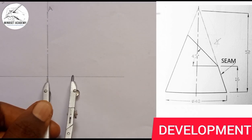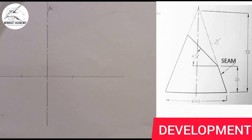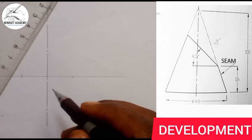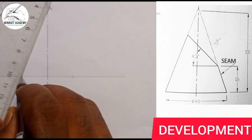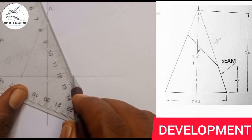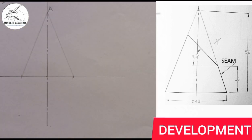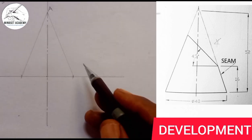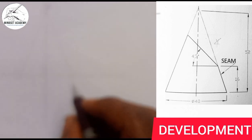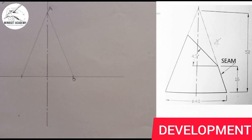I place the center at this point and mark 20 to the left and 20 to the right. From here to point A I draw a front line, and again from here to the same point A I draw another front line, so that from side to side is 40. The arrow indicates where my seam is, so I turn this to be point zero.